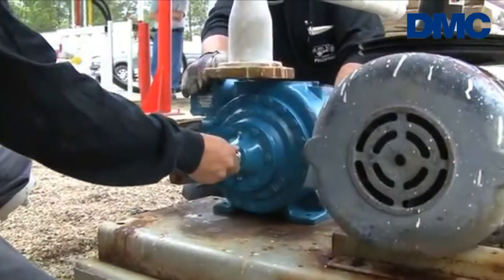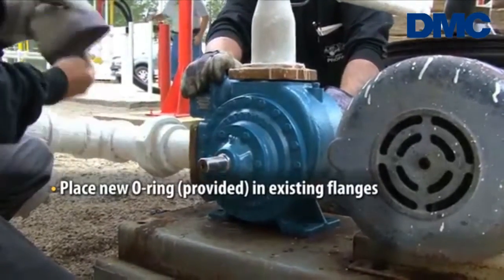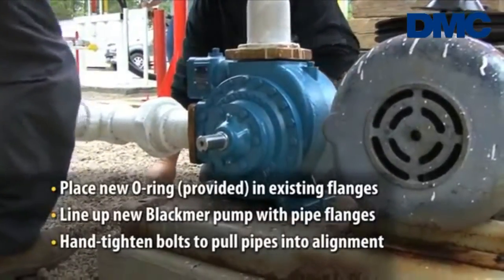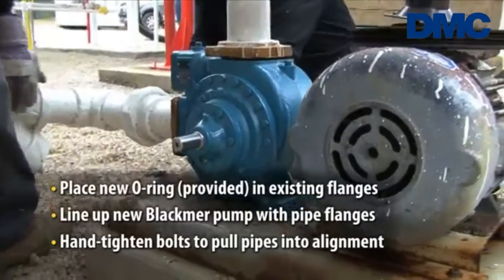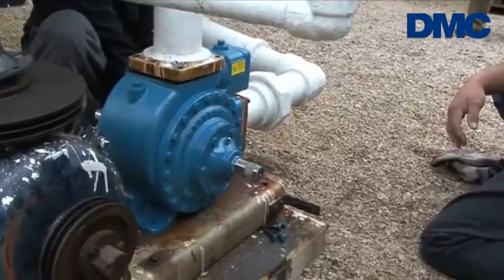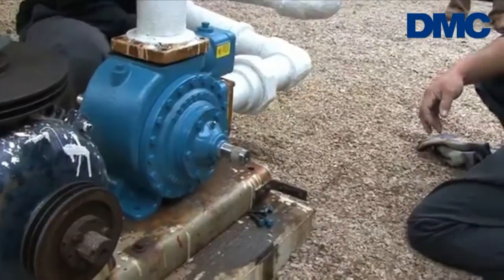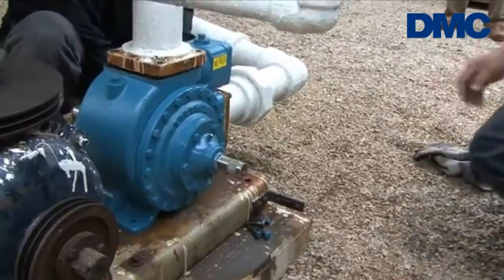She's ready to slide right out and slide the new Blackmer in. This shows exactly how the flange of the Blackmer 3021 series lines up with existing pipe flanges. We'll start the bolts in the holes and leave them loose while we still have the pressure off the piping, and then the bolts will pull everything into alignment. You'll see that the shaft of the pump is pretty much in line with the shaft of the motor, so it's just a small adjustment to align the pulleys and put the belt back in place.